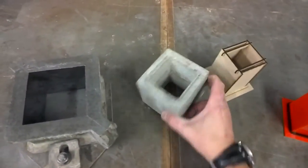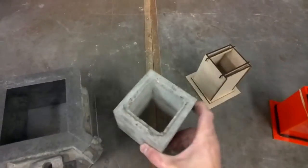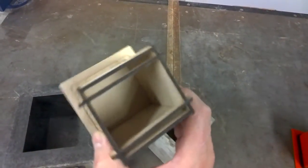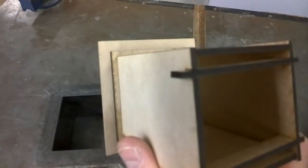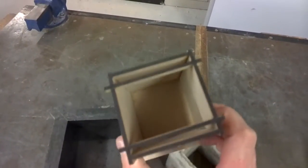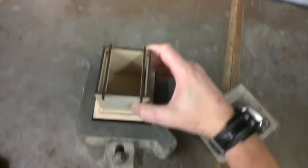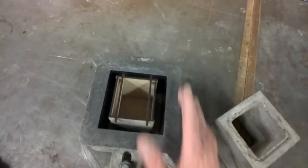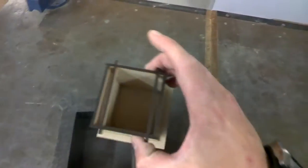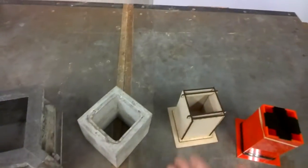What we do need, however, is something to make that core — that hole in the centre of our cube. So we came up with a little MDF collapsible core. This creates the lip at the front and allows the core to be removed easily from the mould once the concrete's set, and it fits quite nicely into the steel plated mould. However, MDF needs sealing, so this was just a test. We're not going to bother using MDF — we'd have to seal every one that we make.